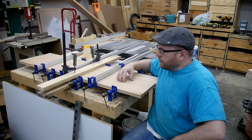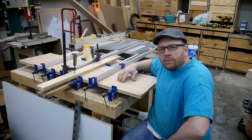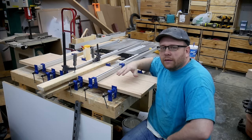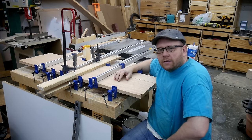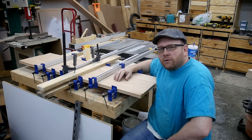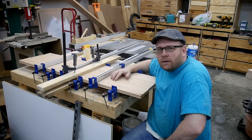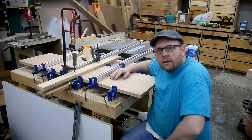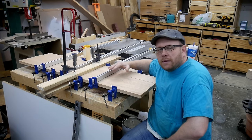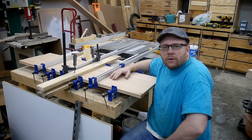You want to make sure you put some other clamps on the top to even out the clamping pressure, and then maybe to help keep the whole panel flat you might add some cauls with some clamps on those cauls to kind of hold everything flat. This is an effective, tried-and-true method of clamping up your panels, but one thing I noticed is that it uses a lot of different components and there are a lot of steps, which can take up time. And all that time you are fiddling with clamps and cauls, your glue is setting up. Another issue is just how crowded the space becomes with so many different clamps and cauls that they start to get in the way of each other.